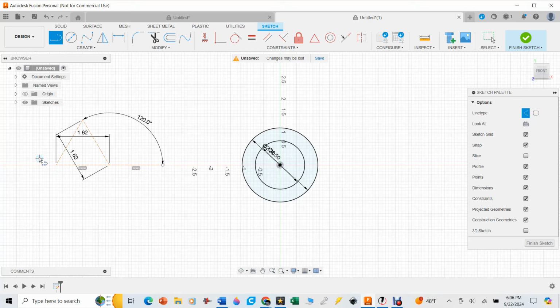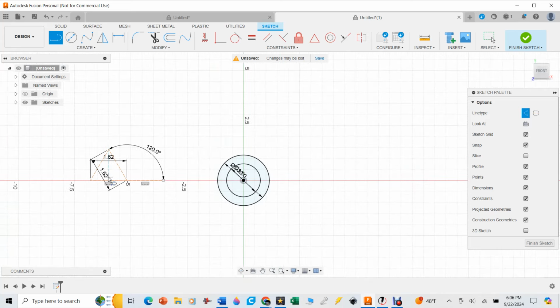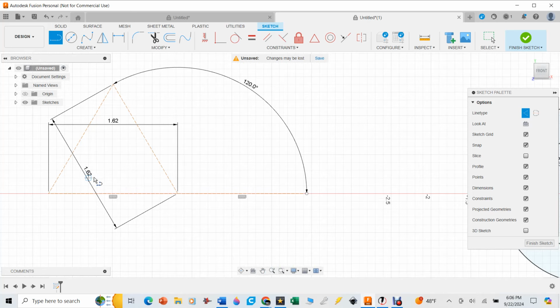I just need to flesh out what the radius is from the center of this if we had that. So what I'm going to do is draw two more lines. I'm going to hit the hotkey L, and you see as I roll my cursor over here, it snaps to that triangle. That tells me I found the center of that line. If I take it to this point right here, then that cuts those triangles in half. If I do that again, and I find the center of that one, and I go to here, now I found the dead center of that triangle.